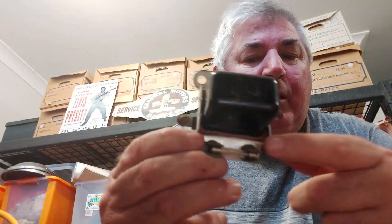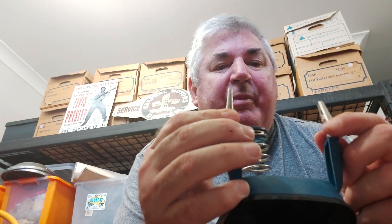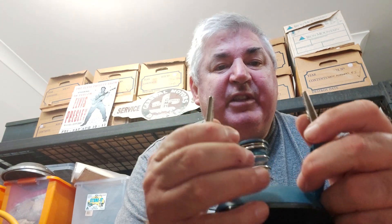Don't forget when you're getting your equipment ready: the RVB relays come in six and 12 volts, and they've got the appropriate fuse there — that's a good thing to check out. Also, a handy hint for soldering: you don't need to be all fingers and thumbs. When you're joining this wire and that wire together, you can get them ready and use the alligator clips to hold things in place, then you can just solder. This makes it really easy.